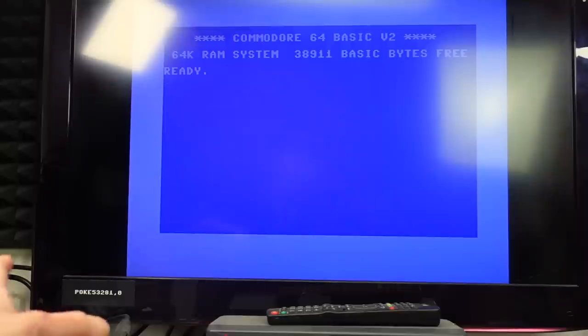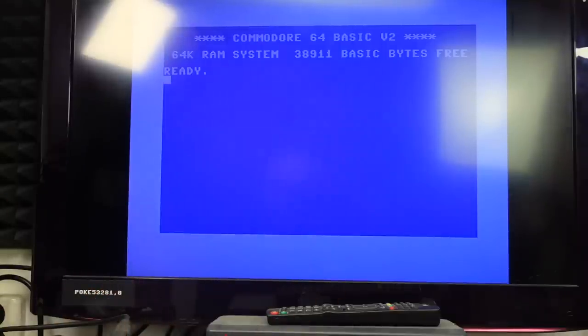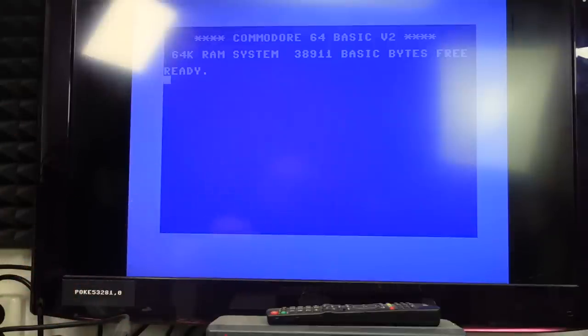So not sure if you can see it, but there's barely any jail bars. And usually they are pretty visible, especially if you use modern screens like this. Or modern-ish screens like this, like flat screens. It works pretty well. As I said, I didn't spend a lot of time on this and still I get a much nicer picture output. So that's definitely a nice feature. Also, the timing chip replacement is a super nice feature that allows me to use NTSC or PAL VIC-2 chips.